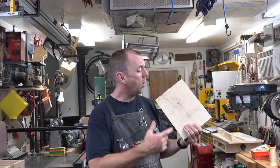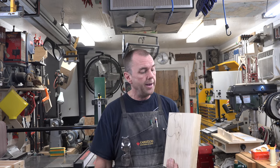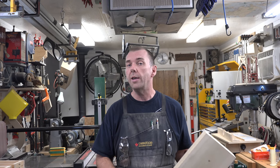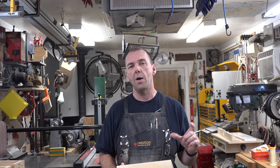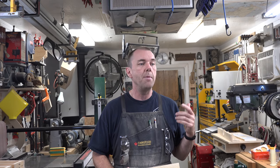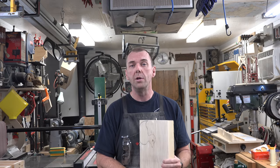Now that your duck has an eye and can see what's going on, it's time to cut out the profile of the duck. Some might say you could use a scroll saw for this, but I have quite a bit of experience with a scroll saw. With this being 2-inch-thick stock, even though most scroll saws state they can cut up to 2 inches, I've never seen one that could do it without trouble — without that wicked blade deflection that causes a curved profile on the side of your cut. Even the best tensioners on a scroll saw can let go when put through that much stress and heat through 2-inch stock. So we're going to the bandsaw to cut out our little duck.